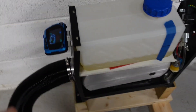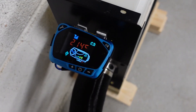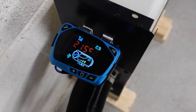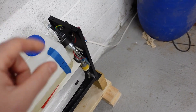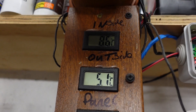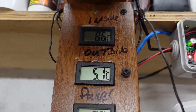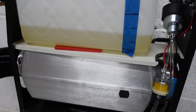The combustion chamber temperature is holding between about 210 and 220°C with the pump modulating — it seems to be doing its thing. Looking at the floor temperature, it's reading 28°C, which is warmer than it was last night — again, odd.